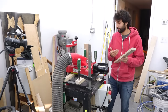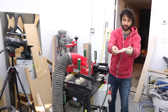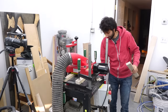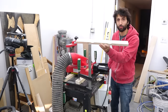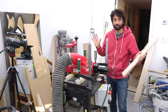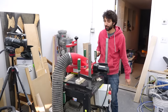But then when I got to the bottom of my cut, the profile ends up dropping down. The fence gets in the way and then the rollers can't push on this thing anymore. So I made the fence taller and I put some dishes in there where the rollers go, so the rollers can be pushing on the workpiece the whole time. That was the biggest thing I didn't really catch at first: the roller height. They gotta have room to be able to push down onto the piece.